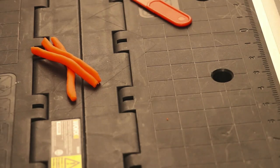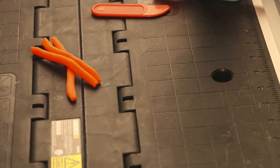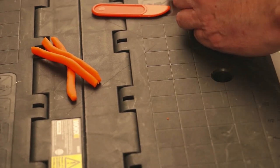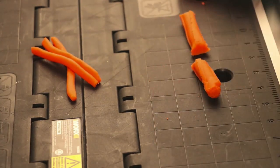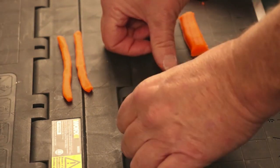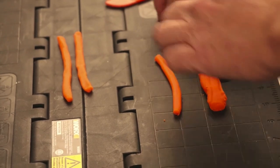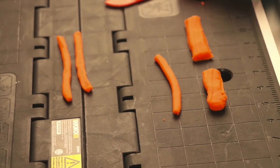So let's go ahead and take a look at the 1 millimeter. Ran out of juice. One on here. There we go. So with the 1 millimeter, now the 1 millimeter is smushed down like all the others. But it's smushed down, it's 0.2 high and 1 millimeter wide, instead of being 0.2 high and only 0.4 wide. So we can automatically see that we get a lot more play to move sideways with an overhang and still have really good layer bonding between the two.